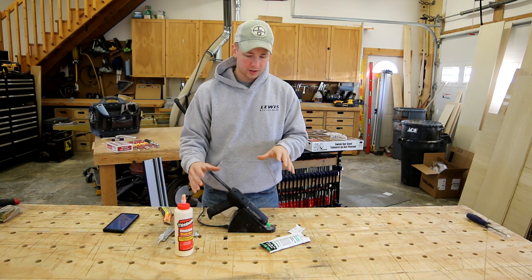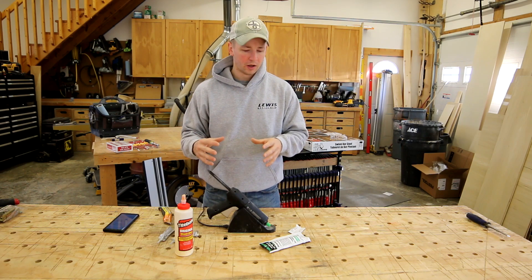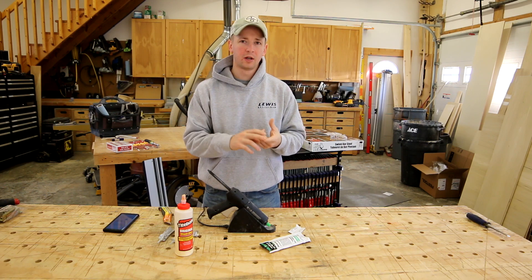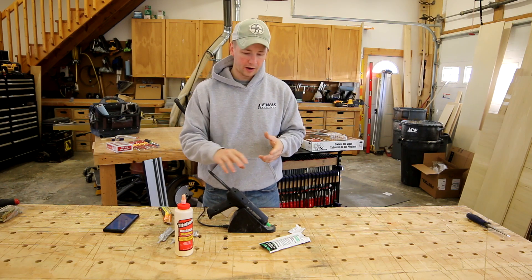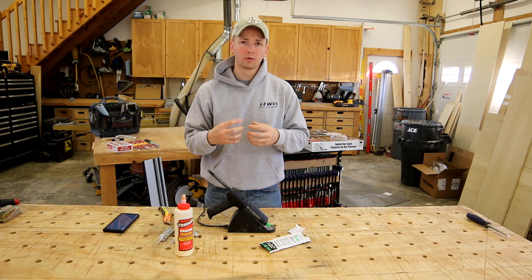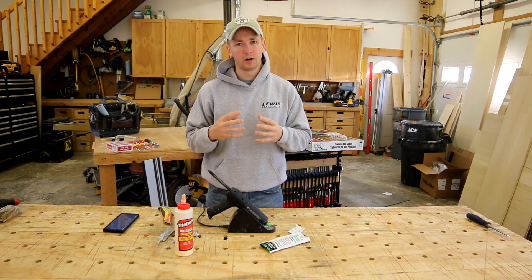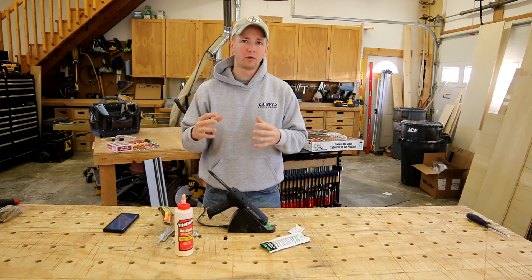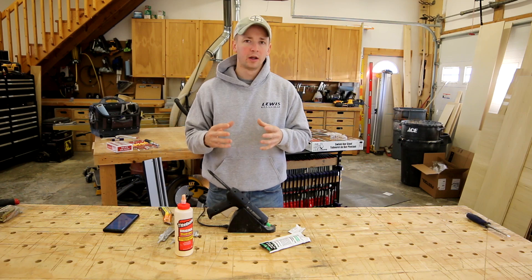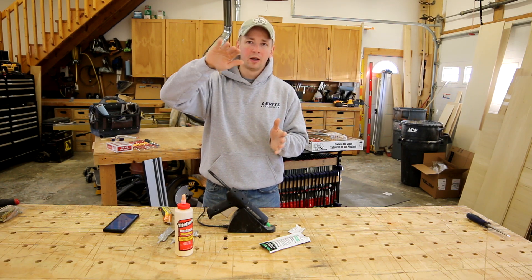To use this product effectively, it's important to understand how it actually works. This is a hot melt polyurethane adhesive — not to be confused with your typical glue stick. There are two components to how it sets up: temperature and air moisture. It has to be hot, and it actually interacts with moisture in the air or in the product you're applying it to, which causes it to cure. The initial cure strength is very strong, but it will continue to cure for the next 24 hours as it interacts with moisture in the air and in the product.